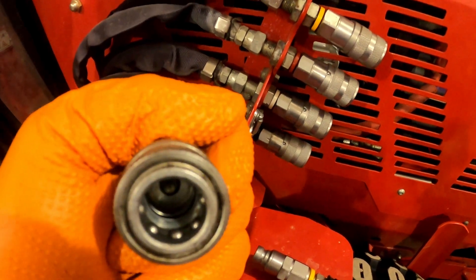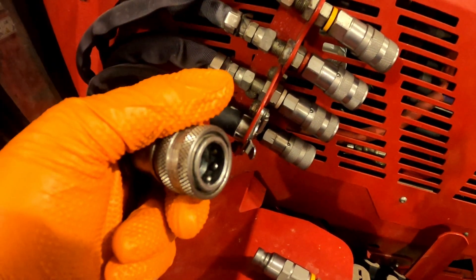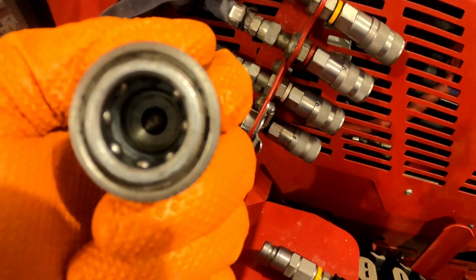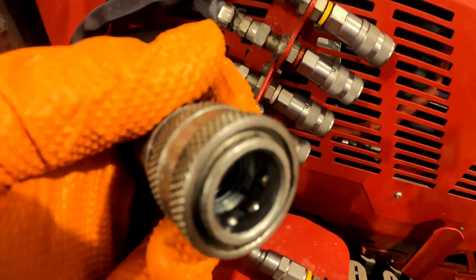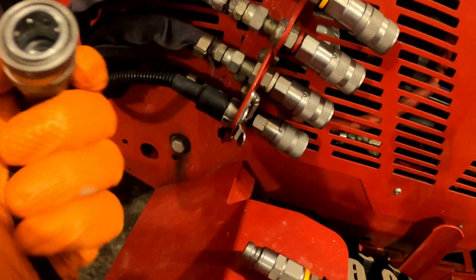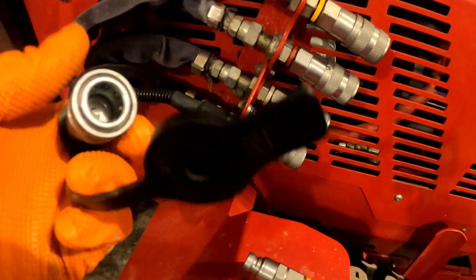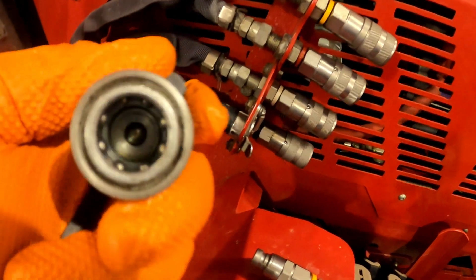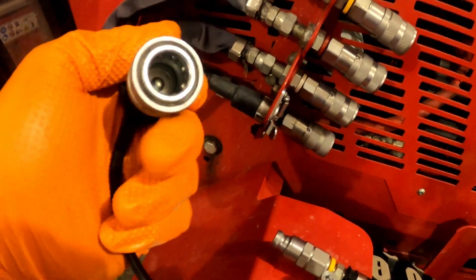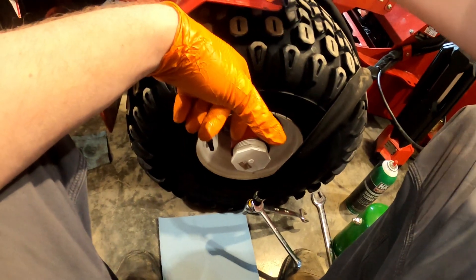Regarding contamination with the pioneer style couplers — this is the female. You have this cavity that the male has to enter to connect to the female. This cavity is where most of your fluid is lost. Because of this cavity and the oily residue around the coupler, it attracts dirt. You do have this little plug to help reduce the amount of dirt that enters the cavity. Anytime you can minimize the amount of dirt or contaminants in your hydraulic system, the better.